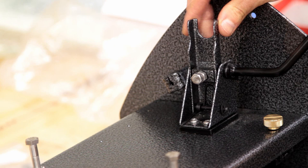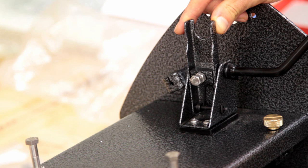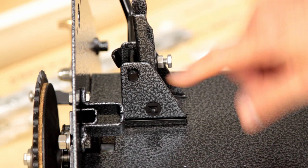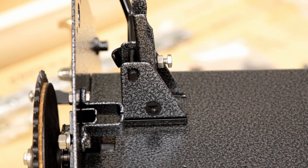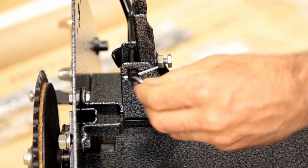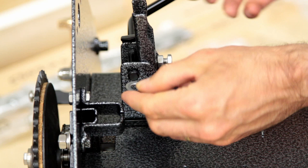If we were to turn this screw a little bit further — this little set screw — basically that's going to adjust the position of this clutch fork so that when we're engaged, it will determine how far we're pushing the clutch cone along that PTO shaft. Looking at the clutch handle from the back side now, there's a small little hole just on the tail end of that handle piece, and it receives a little split pin which passes through that hole and then wraps up and around either side.